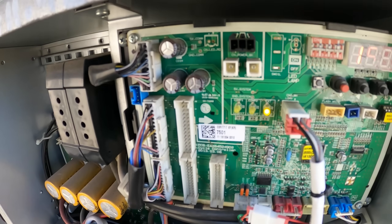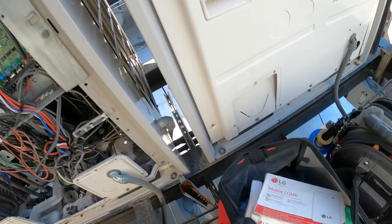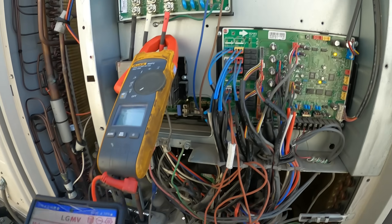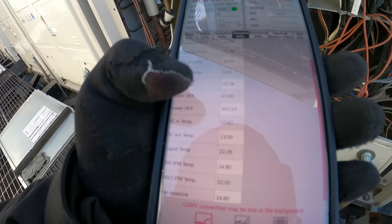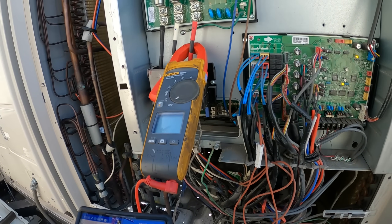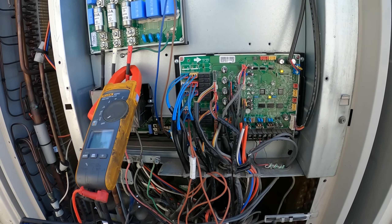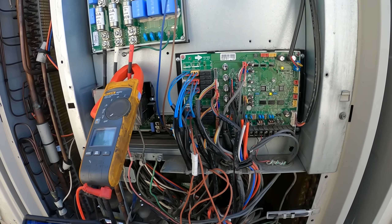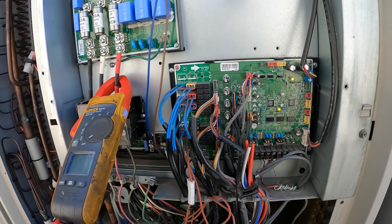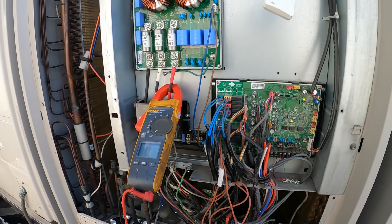I've got this LG MV tool connected to our main board — the mobile LG MV tool. Lower HEX is reading 302 degrees, and that's the one we're not getting voltage on. SC-in temp is reading about 18 degrees — kind of close, maybe the pipe makes it a little colder — and that's the one we are getting voltage on. We're getting the same resistance between both sensors, but one is not getting voltage, so it's really a bad board. The best thing to do is change this board along with that thermistor assembly.